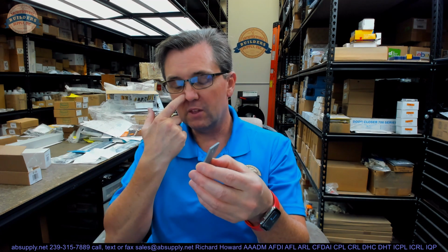the door. But it's a fire door, and you can't leave an open void in the edge of a fire door, so you'll need to apply like material or similar like material from what the door is made of when you blank that off. This would be found to be agreeable in that sort of application. Even though this hardware doesn't bear a UL label, it is of like material and is a filler plate. Okay, that's what it's used for.